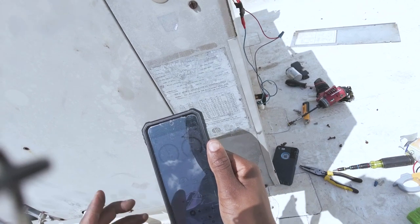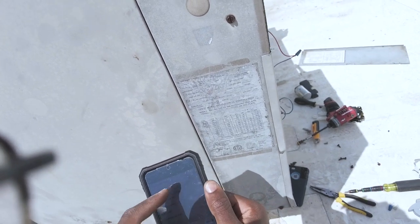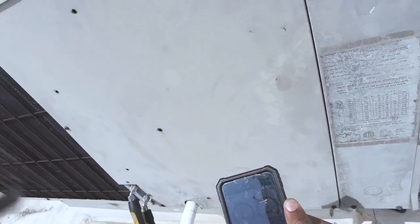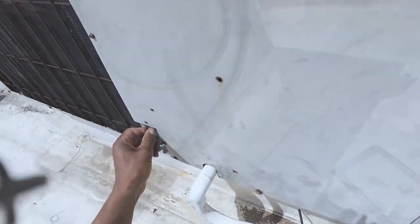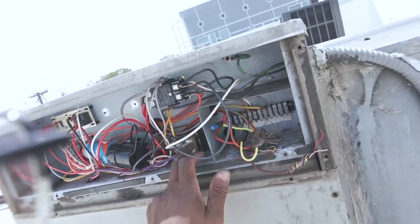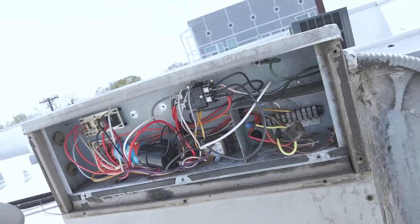Let's go ahead and do a quick check of our pressures and check the temperatures inside, then we can call it a day. I've got a 37-degree coil and it's about 70 degrees inside — putting in our indoor return, we're right on where we need to be. I'm satisfied with that. She's running now, got everything buttoned back up. We salvaged the old transformer, everything looks pretty good. Like always, we'll see you on the next one — thanks for watching.